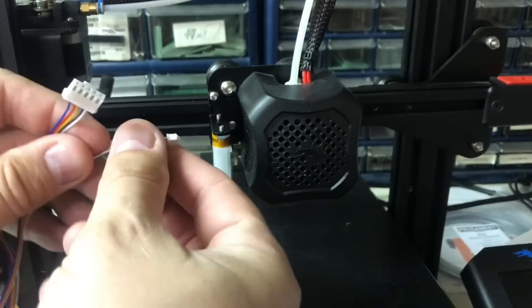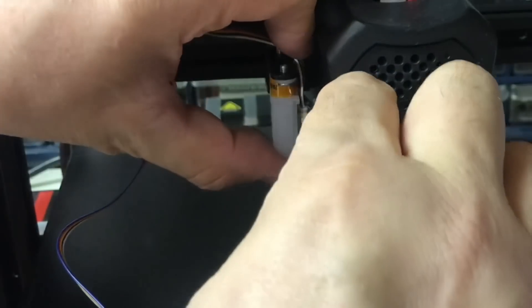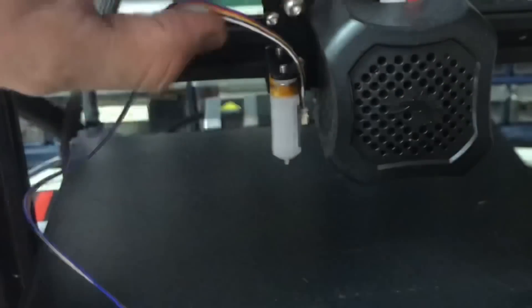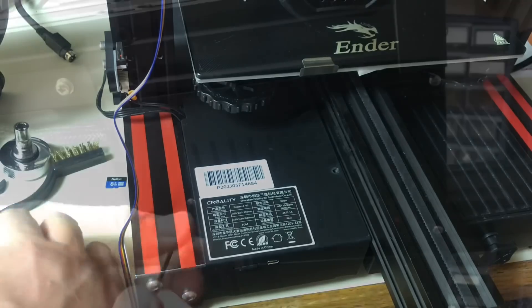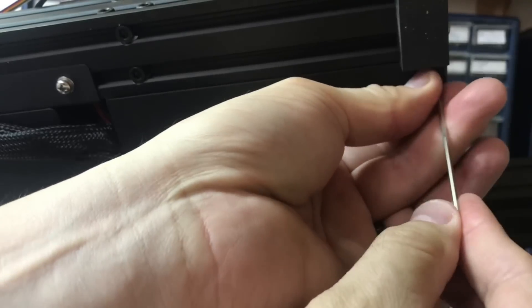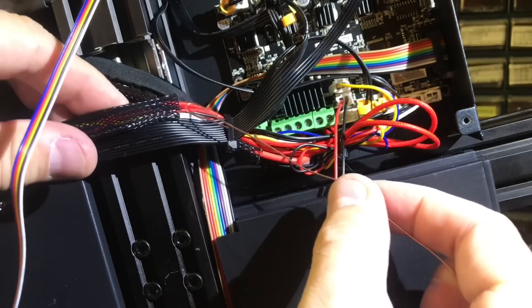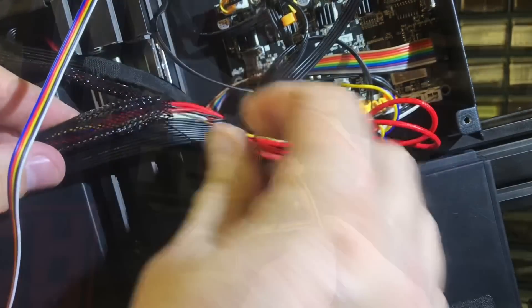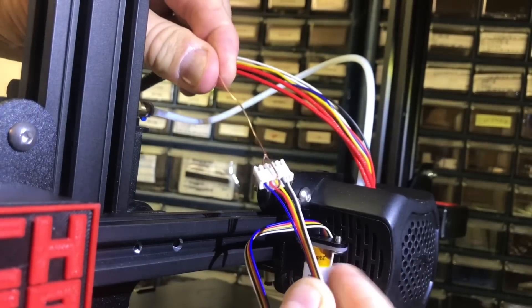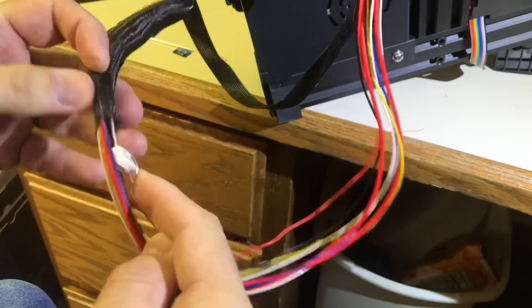The wiring has a large connector and a small connector — the small connector goes into the BL Touch. I should have put this wire in before installing the BL Touch, but I was able to get it in place and push it down with an Allen wrench. I cut off all the tie straps around the wiring loom and removed the cover from the electronics. I then took a long piece of copper wire, looped the end, and slid it into the sleeving surrounding the wiring. Once through, I wrapped it around the BL Touch connector and pulled it all the way through, wiggling it as needed.